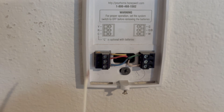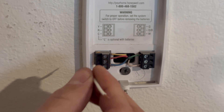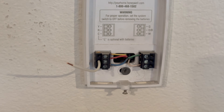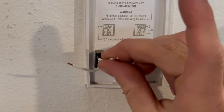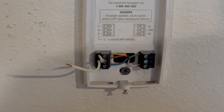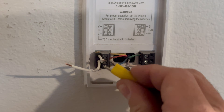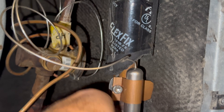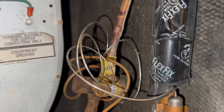Next I'm going to make sure that the cooling is working from the wires. Keep in mind this is low voltage but it is live. I'm going to stick one jumper into the red and one into the yellow. When these two wires touch together it's going to kick on the condensing fan and the compressor only. I can hear the refrigerant flowing through the TXV and our suction line is getting ice cold, so our wires up to the condenser are good.